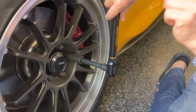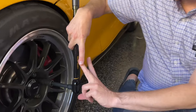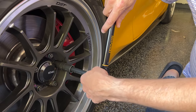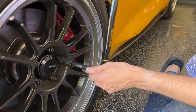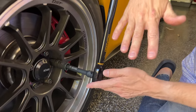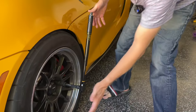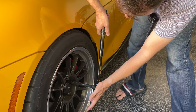I'm going to tighten it to just one click, but you're actually going to hear two clicks. When I tighten it to the first click, when I'm done, the gear is going to pop onto the next tooth and make a second clicking sound. But you stop after the first click. So I set it to 95 and I'm just going to tighten it up gently until there's a little bit of tension on it, and then I'm going to move it in one continuous stroke until I get the click. I'm going to put my hand here to reinforce the whole thing and just do one stroke.